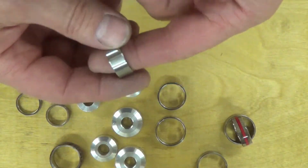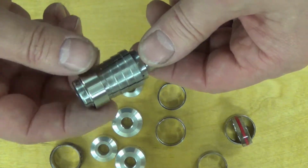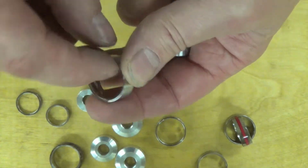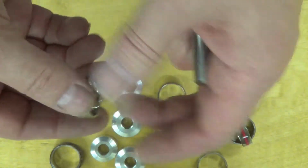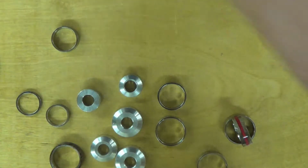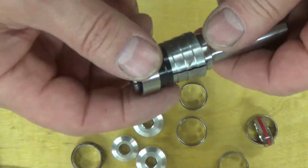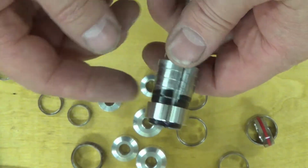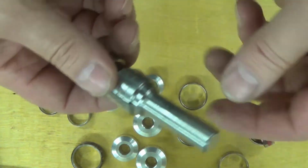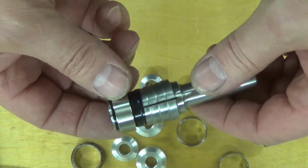Now, to mill this down, I'm going to use this ring mandrel, which doesn't fit these cores very well, because I don't know if it's the domed interior that won't allow it to slip onto the right size. But what I usually do is wrap this with a little bit of electrical tape. I'll get that centered up. The Maker Hive doesn't yet have a metal lathe that I can easily turn this down on. But we do have a mini mill, so I'll chuck this into the mill, clamp the tool, and shave this side down.